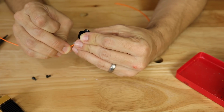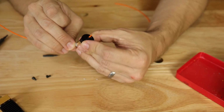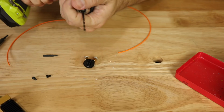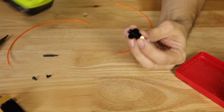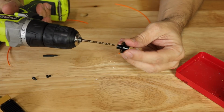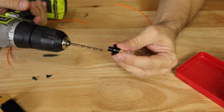I'm still catching it on this side. Let's check the other side. Again, really close, still not quite there. So next up in my drill bit set is the 3.5. So we're gonna do that one next. Moving up like this is also keeping this from catching on it really bad, because if I go up gradually, then there's going to be less metal for it to catch on.